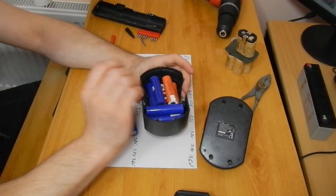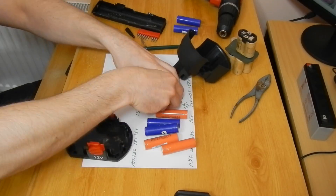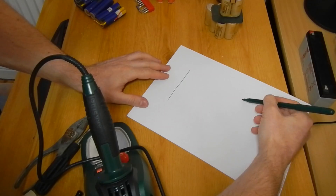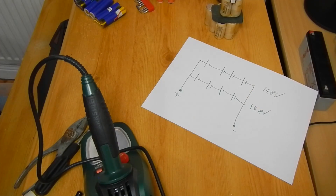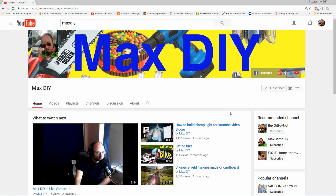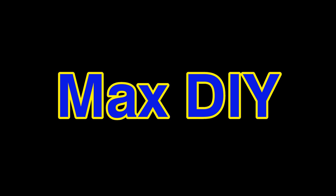Having the 18650s carefully aligned inside the housing, I decided to use eight cells in total in four two-cell packs, giving me 14.8 volts at 2500 milliampere hours. That's it for today. Remember to turn notifications on after subscribing to my channel so you can see the second episode of me getting the drill back up and running.